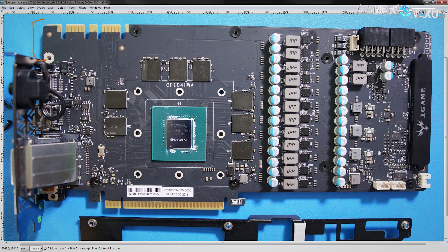Now we're going to move into the actually interesting VRMs, even if they do just as much as the other two in terms of overclocking on air cooling and water cooling. This right here is the Vcore VRM, which provides the bulk of the power that the GPU uses, and behind that we find the memory VRM, which powers the GDDR5 memory chips located around the GPU core.